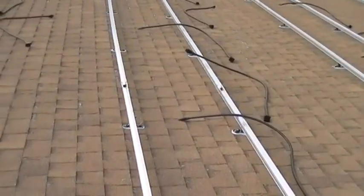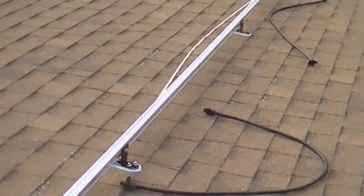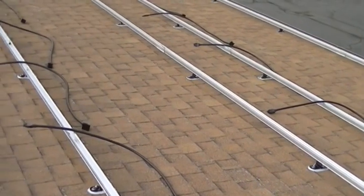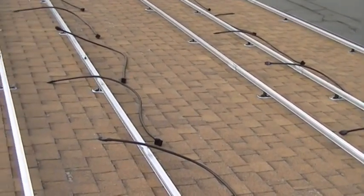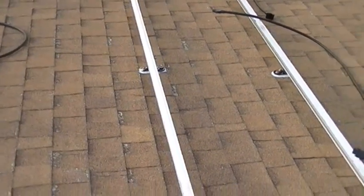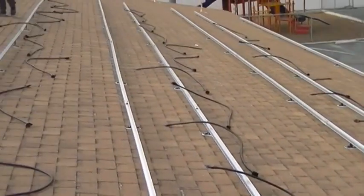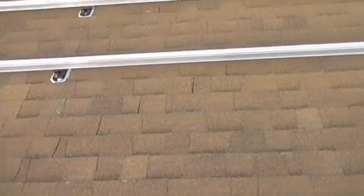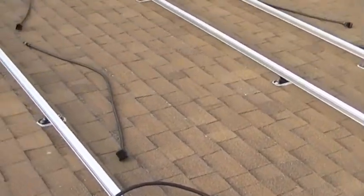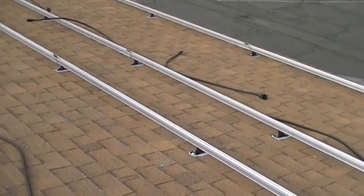We're going to lay the inverters out. I'm also going to seal up any cracks — this is a pretty old roof, they may have 10, 15, 20 years of life left on it. I'm going to recommend to the church to use elastomeric paint that paints comp roofs — you can choose nice colors. I'll seal up any cracks and lifted shingle tabs with roof sealant. That way it will be sealed from underneath and they can paint around it later to protect the rest of the roof. A cheap way to fix a roof — those paints really come a long way, for a fraction of the cost of re-roofing.